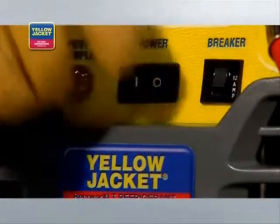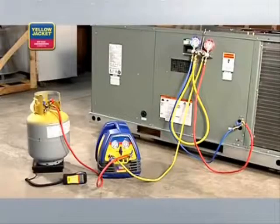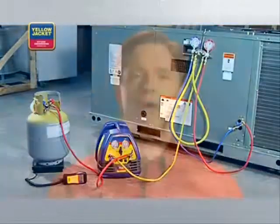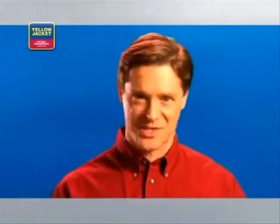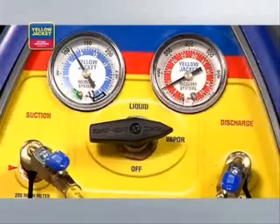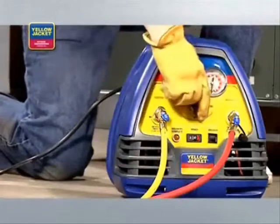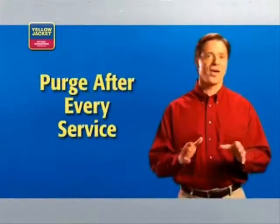Go ahead and turn your recovery unit off and close the liquid valve on your recovery tank. Now you can reconnect your hoses as in a standard vapor recovery. Push-pull is really fast when you have the right setup for it, but it is a two-step process, so it's not always the appropriate method to use. Once the hoses are reconfigured for vapor recovery, turn the selector valve to vapor and run the vapor recovery process, continuing until the unit shuts off. Purge once more before you begin servicing your HVAC system — this final purge clears the recovery unit of refrigerant, reducing the risk of cross-contamination and prolonging the life of your equipment. You must purge after every service.